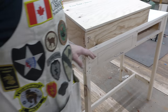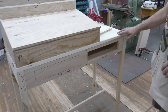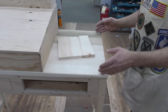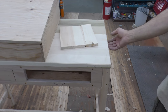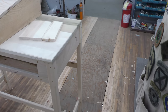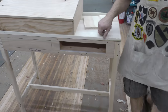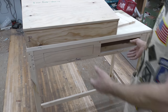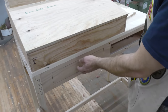The lid will also be MDF banded with veneer on top and bottom so there are no issues with movement. If this was a solid piece of wood it's going to expand and contract, which just complicates things further. We'll also have that same little drawer over here on this side. And then we have two big drawers here. I love making drawers, so that's probably the reason why there are so many. We cut this out of a piece of plywood just to kind of get the proportions.